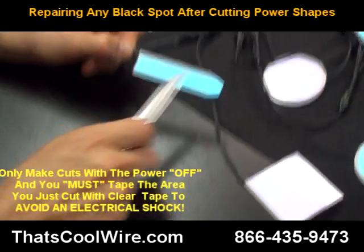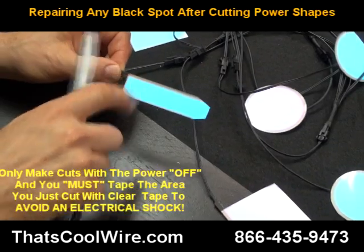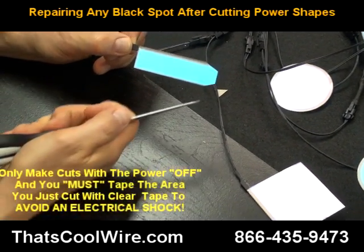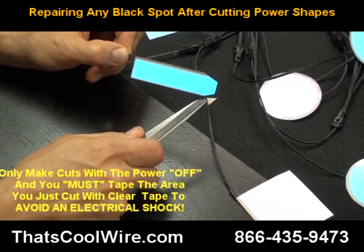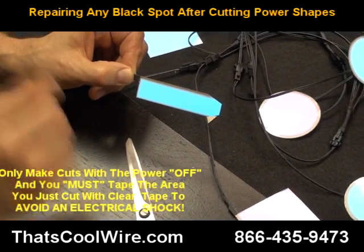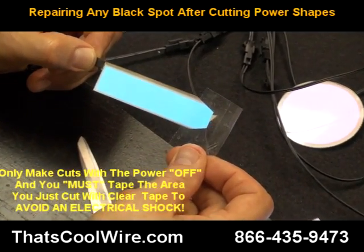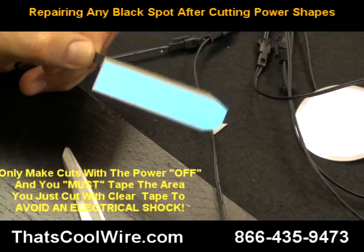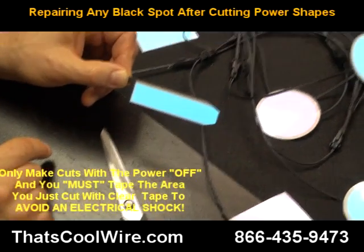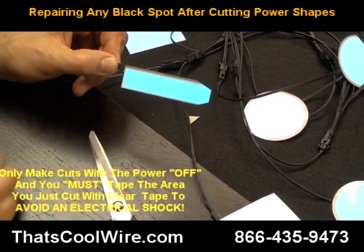There's a shiny laminate on here that protects the lighting element underneath it, and there's a little lip on each side so when it's heat sealed it's completely sealed. When you make a cut you are now breaking the seal on the end — you don't want to touch the end or you're definitely going to get shocked. You just want to have some clear tape to fold over and trim, but make sure the clear tape is coming over all edges. It gets a little trickier if you're making an S-curve, but you have to make sure that gets covered.